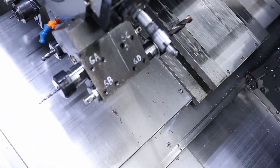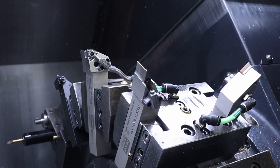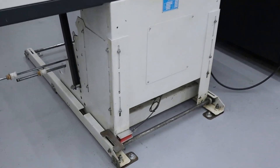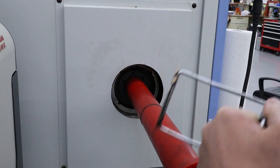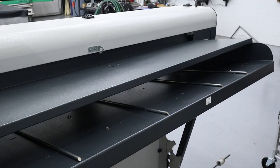It's a little bit tedious setting up the lathe turret, but it's not too complicated. Typically the preferred lathe workflow is to make a bunch of the same thing and amortize the cost of the setup over all the parts you make. You can roll the bar feeder out of position. Check out these tools I made — these are like canning jar tongs. I welded some little lips on there so I could yank it out. It's actually very difficult to extract a spindle liner without a special tool like that. I think we're about ready to just hit the button and start ripping — I'm sure there will be little offsets and tweaks and probably some troubleshooting, but I just need to cross my fingers and start running it.